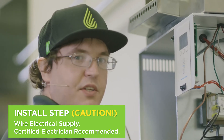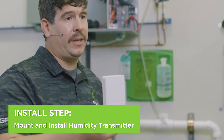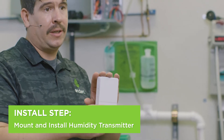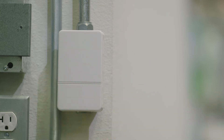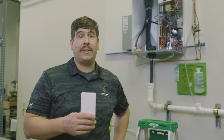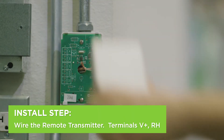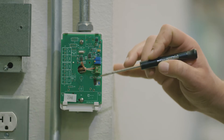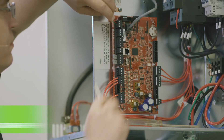Now let's talk about the humidity transmitter. When installing it, find a central location outside of the lights and away from the outlet of the steam humidifier so that you don't adversely affect the humidity reading in the space. There is a schematic in the installation manual showing convenient locations. Wire terminals V-plus and RH on the humidity transmitter to terminals 24V and RH at P11 on the control PCB in the humidifier.